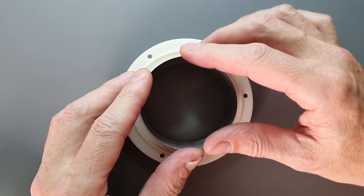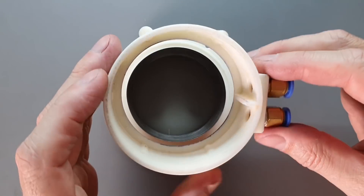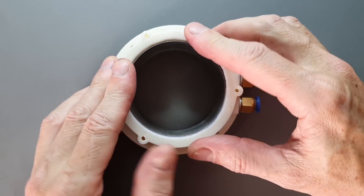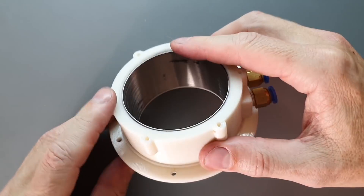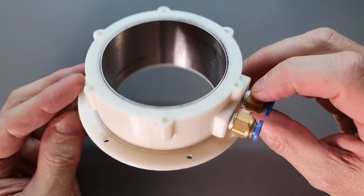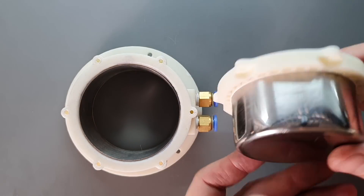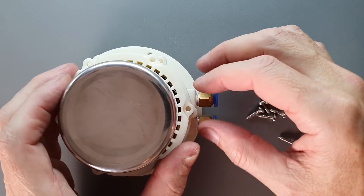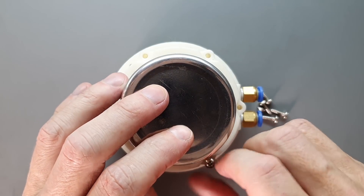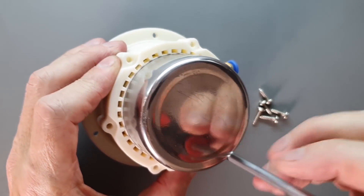The water jacket and the diaphragm flange plate get glued together. The cylinder is slid in and then the whole thing gets sealed up on both sides with more high temperature red silicone. It's really hard to get this thing not to leak, but luckily it's usually under negative pressure, so it just sucks air bubbles into the cooling water. The hot cap and the water-cooled cylinder assembly then get screwed together, and I had to make some nice formed-in-place silicone gaskets to make sure the joint is airtight.